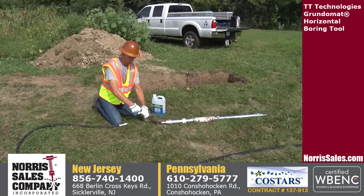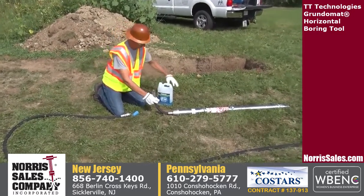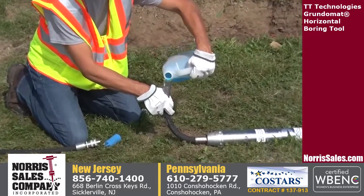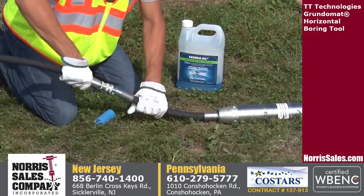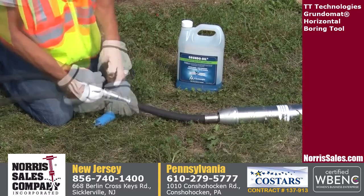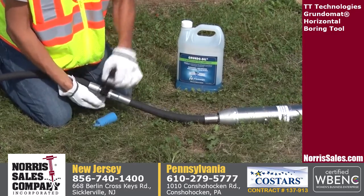Pre-lubricate the tool. A quantity of Grundo oil, about 4 ounces, can be added to the tool's air hose before operations. This will help ensure smooth starting. Connect the air hose to the tool and tape the connection. Make sure that the couplings are securely interlocked and the safety rings tightened. Wrap the connection with adhesive or electrical tape to keep dirt from getting into the air line.